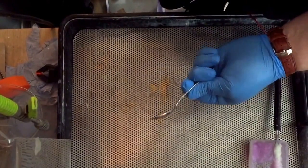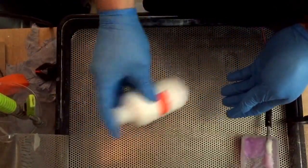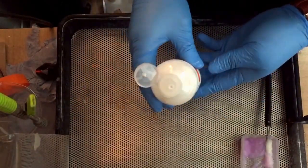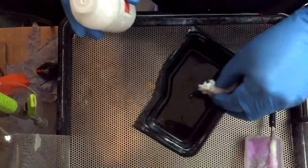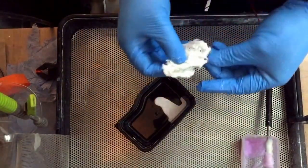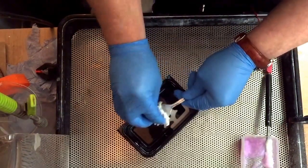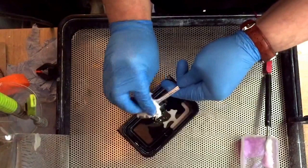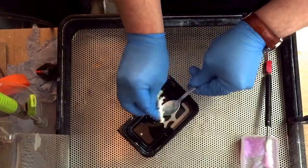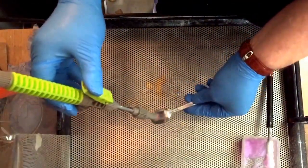For cleaning and activating we use MPU — you can get it at my shop. You can use a tissue or a swab to wipe it in — you clean and activate at the same time. It's brilliant stuff for smooth areas. You can use electro cleaner and electro activator if you want, but that needs another swab and electrode and rinsing in between. With MPU you can even leave it on — you don't need to rinse if you don't want to. I always rinse it anyway — it doesn't contaminate at all.